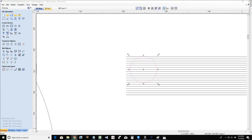I don't care if it's a half inch diameter bit, you can break it right in half if it can't keep up and remove the chips fast enough. So chip load, your optimal making chips and everything, has nothing to do with being able to keep up with the depth of the cut. So you don't want to be too aggressive with your depth of cut. Okay? It's got to be able to keep up. So 50% the diameter of the bit or less.